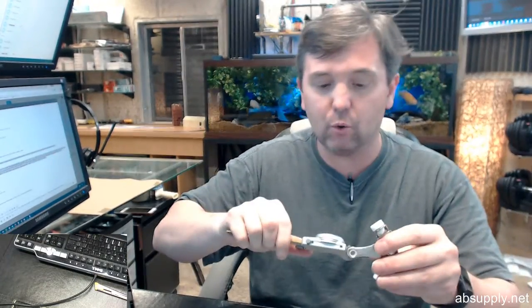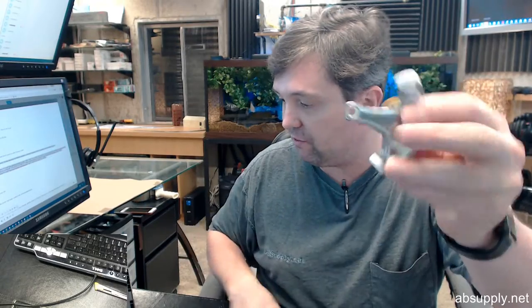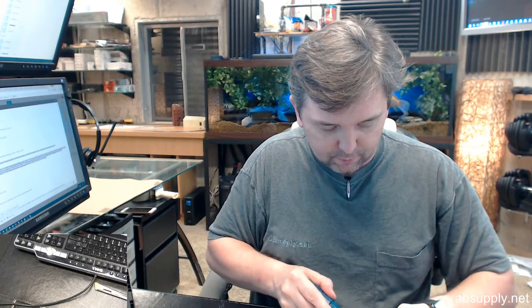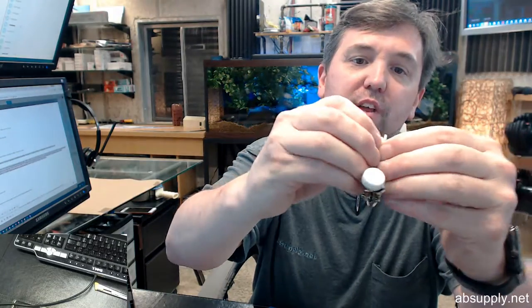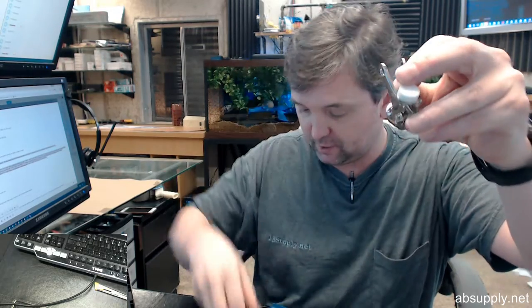Now, removable bushing, the part number says removable nylon bushing. The diameter of the hole here, that's a common question. The caliper says that it is 0.245 inch. So it's basically a 1/4 inch. What is it if we were to remove it, is the question. Very common question, actually. The removal process really just involves spreading those parts out a little bit so that you can get that nylon bushing and just slide it out. Obviously, spreading those apart is accomplished by loosening the screw. You can get those opened way up, and the bushing will come out.